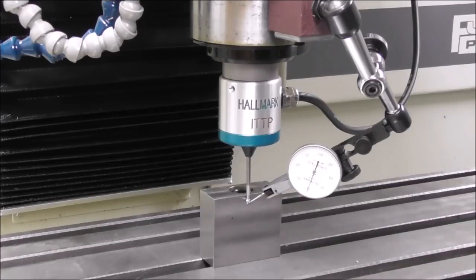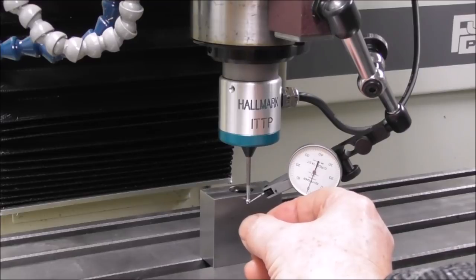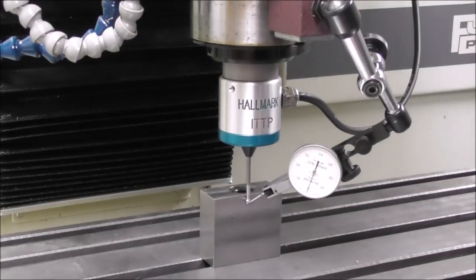The pre-travel variation midpoint is a distance - say two hundredths of a millimeter - and that is a radius dimension. So you would reduce the stylus tip diameter: measure the stylus tip with a micrometer, and instead of entering four millimeters in the tool table, you would reduce the diameter by two times the radius of the average pre-travel - so two times two hundredths equals four hundredths less, giving 3.96mm. That is the effective diameter, not the actual diameter of the stylus tip.